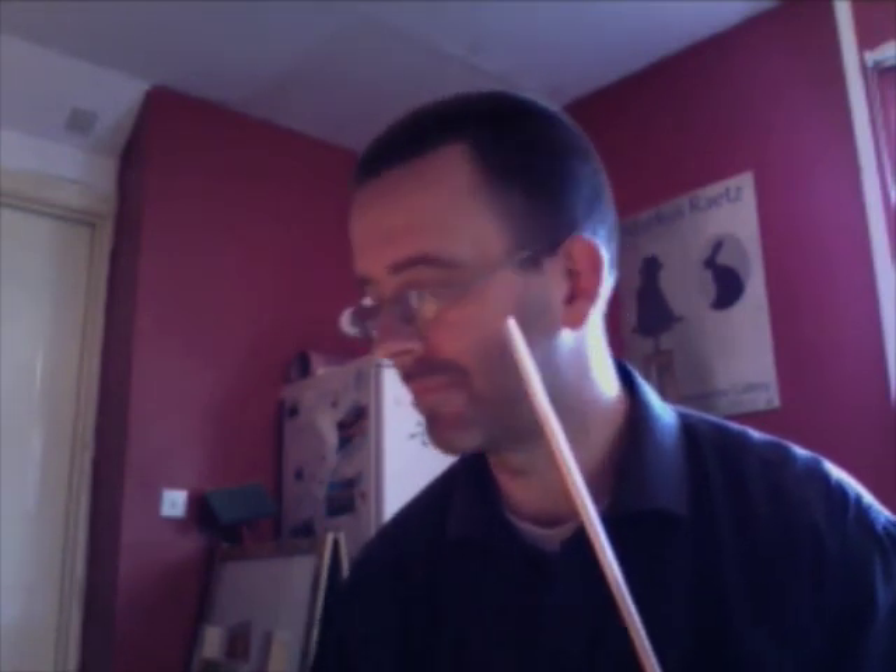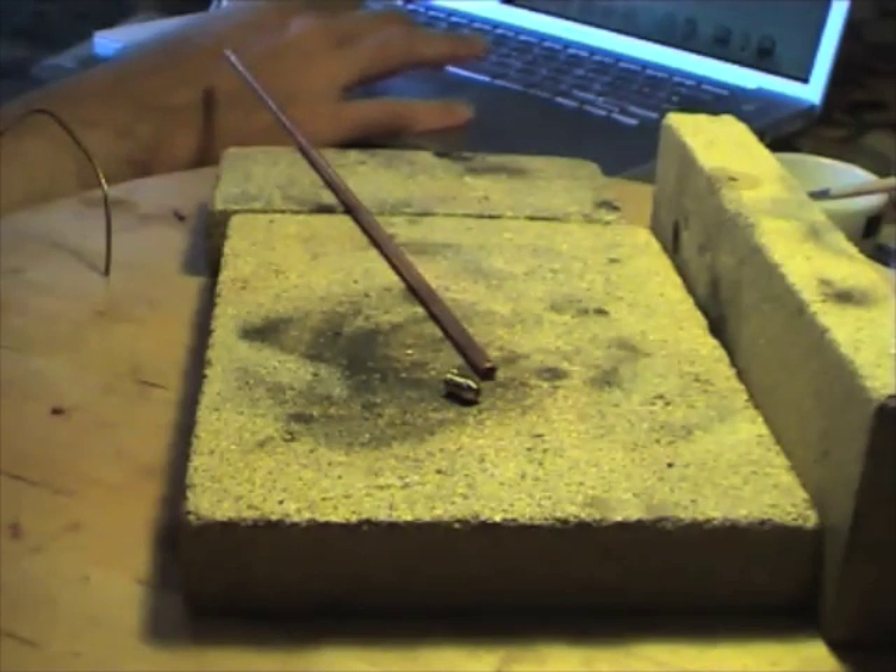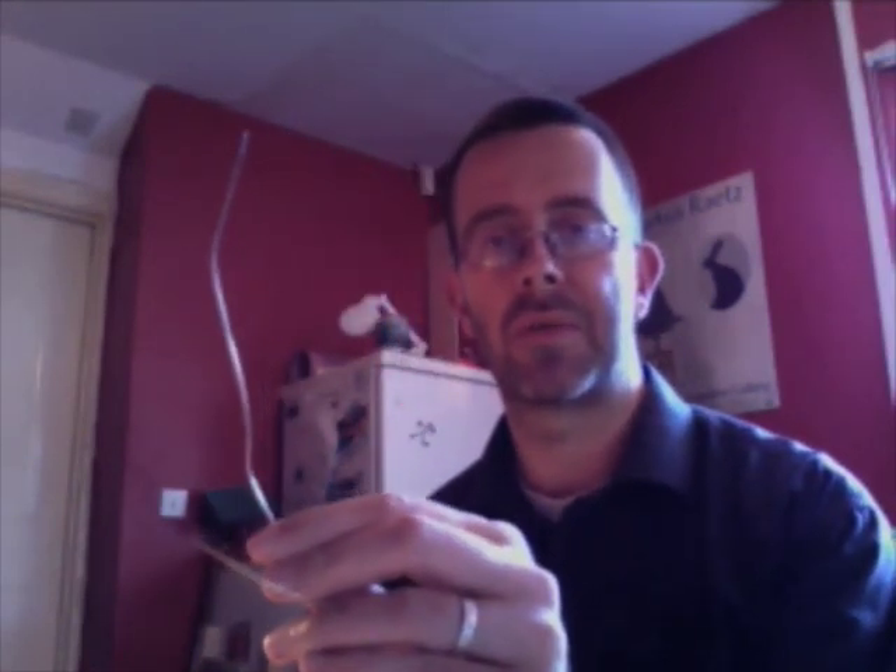Just to debunk that a little bit. What I'm going to do is take this bit of pipe and solder on this ferrule — this little thing here. We're going to silver solder it so it will withstand higher temperatures, and then it can be used for all sorts of things like higher-temperature airbrushes. There are our two work items. For this we need, of course, those two bits, plus some silver soldering wire. This is Easy Flow number two, which melts at 640 degrees centigrade.